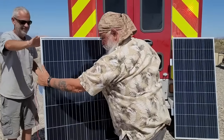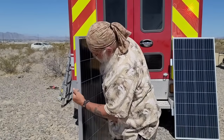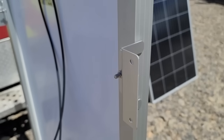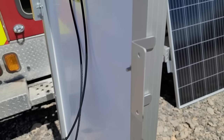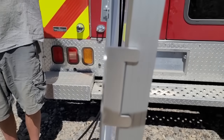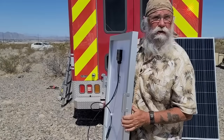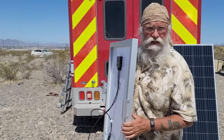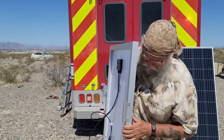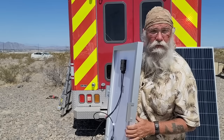Let me show you the feet - we've already mounted them. There's a hole in the panel they go through where it mounts, with a bolt that goes through there, and these will screw straight in. You must always have feet that lift the panel off the roof - it's up about an inch. You have to have airflow. Panels want to be cold - that's another reason we're over-amping right now, because it's still a little cool with a breeze moving air all around it.